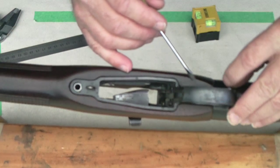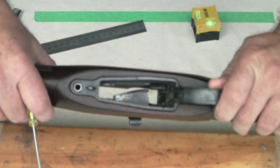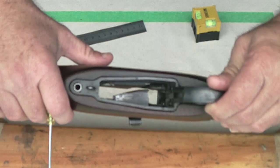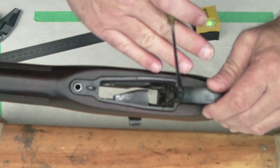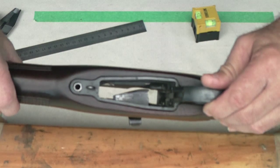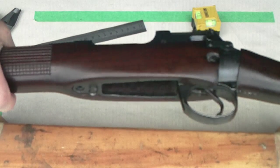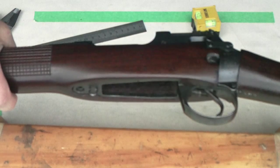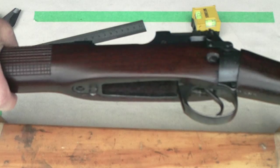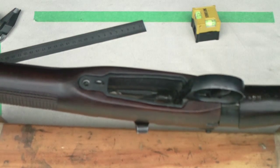Back under here it's a little trickier, but it just depends on careful assembly and not too much pressure. The idea is you're trying to take up any air gap back here under the trigger guard when it's assembled, because if there is an air gap your fore end is floating and not being pressured into place like it needs to be. Bedding the trigger guard is a good place to start and get some experience with bedding — it's not complicated. Regular slow-curing epoxy is way better than fast cure: you have more time to work it and the eventual cure strength is much much better.